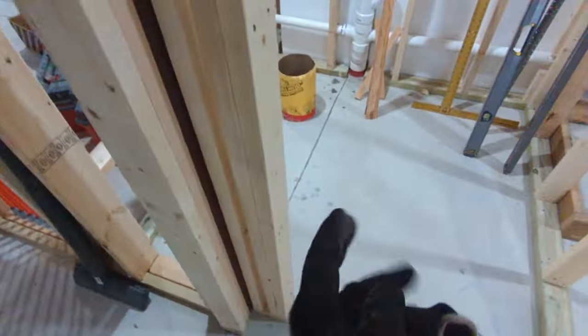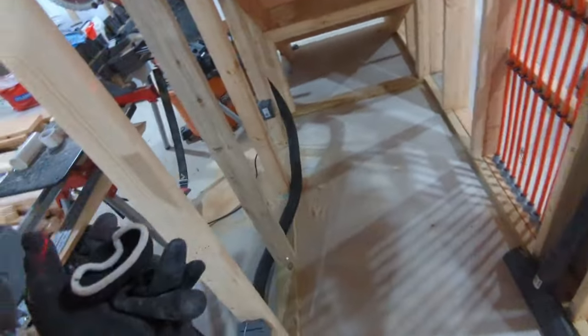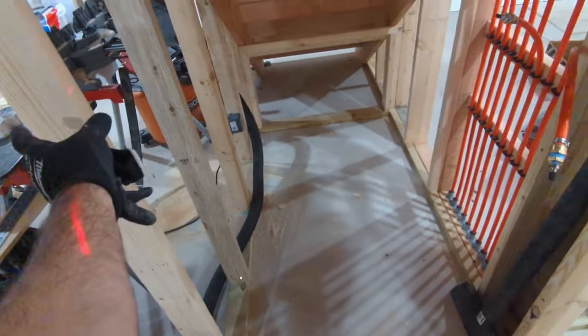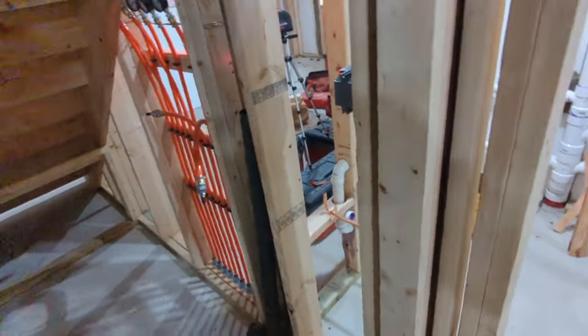What did we say? If this door opens right-hand in swing, and you're coming out through the door, you don't want to get smacked in the mouth with this door swinging open for whatever small, unlikely reason that someone's in there and opens the door. So really this needs to open this way because it can't open in. It would open out like that. So then your switch really would be over here. And so I may put a light switch there and have a simple circuit and just probably put one of those ceramic bulb base holders right here, or maybe face it down somewhere, where you can just slap a light on, see what you're trying to do, and get back out. Oh, I forget, this isn't going to be open.